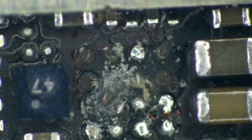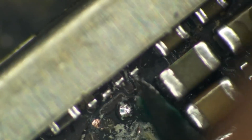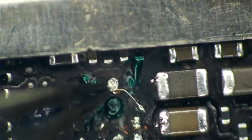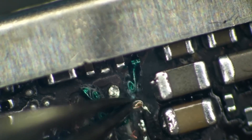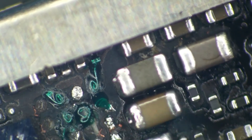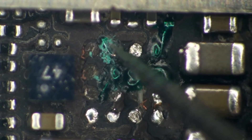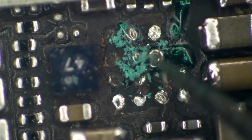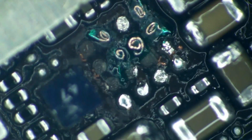The next part of this process was pretty extensive. I carved around on the board and dug out any vias and little bits of leftover traces, and anything on the vital lines that I would be able to use. I soldered on little jumpers and created little snakes, repaired the pads, and got this thing ready to receive a brand spanking new IC. Each one of our new pads is covered in green UV mask, and after the mask is cured I come back through and carefully scratch off just the top layer. It looks pretty much brand new.